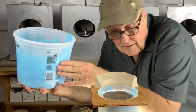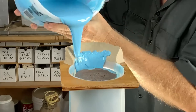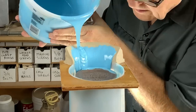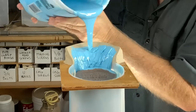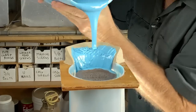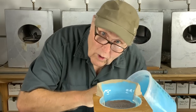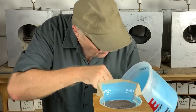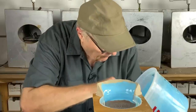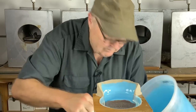We're going to pour a big bucket of rubber. This funnel will allow me to just dump material and it'll fall in a sheet just like that. I'm pouring much faster with that funnel than I could without it, and yet the clay is under very little pressure. It's warm in the shop so I don't want to take forever to pour this rubber. People ask me why I don't have spatulas and other fancy tools — I always just use sticks. I'm based in a wood shop so I always have sticks of all different sizes and shapes. They work. They're simple, available, and free because they're leftovers.